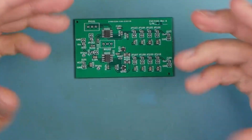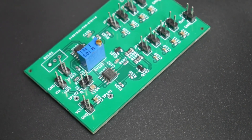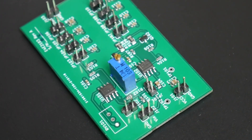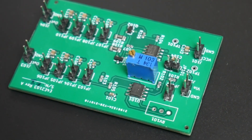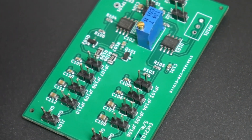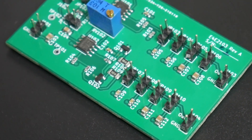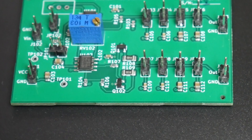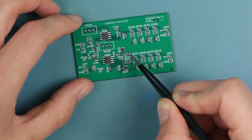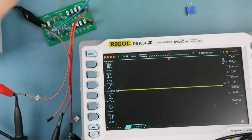This isn't really a design or a project — it's just talking through some concepts. We have two seemingly ideal implementations of an OP07 two-times amplification circuit. One goes straight op amp to load. We've got capacitive loads that we can switch in and monitor the output, as well as a BJT buffer on the output of an OP07 which then drives the load. These are 2.1 ohm resistors. We have the oscilloscope set up with channel one connected to the unbuffered output.